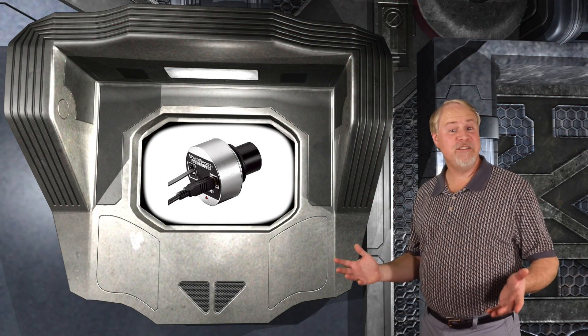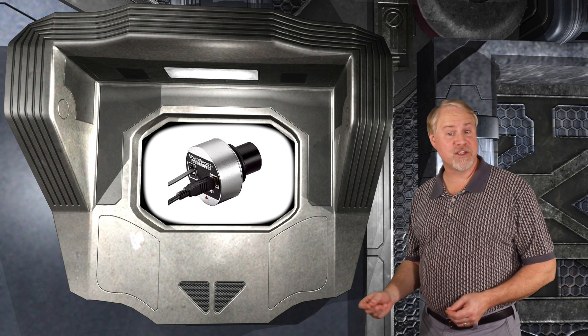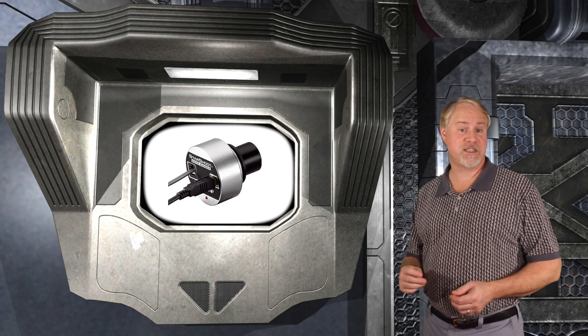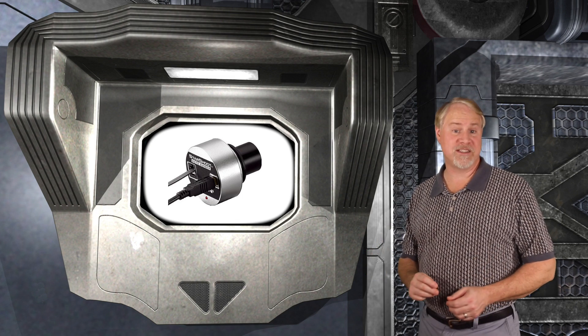The ST4 cable and connection port is what connects back to your telescope to allow it to respond to the auto-guider's position correction commands. This is a standard RJ12 6-pin modular phone plug — an industry standard — and most computerized telescopes have one.